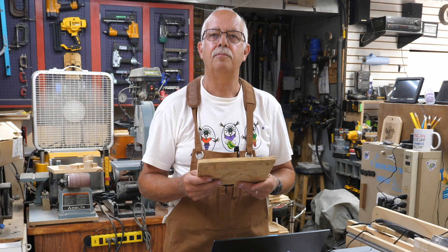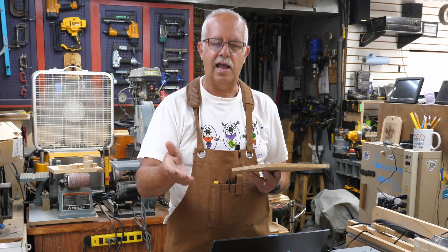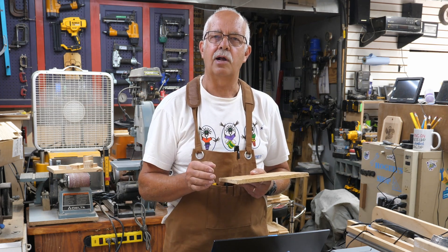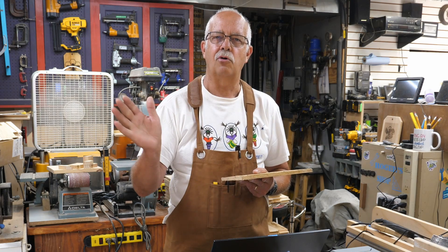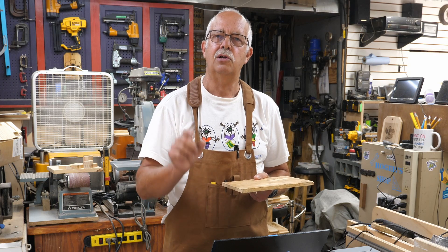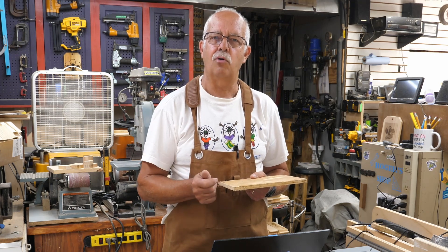The viewer that sent me an email said they had some to cut. They have a Longer Ray 5 with a 20-watt head on it — that just happened to be what I had set up here today. So I'm going to run a laser cut test on it. There'll be a link in the description for that file if you'd like to download it — it's free. It's important to run tests on any material you use to establish settings for your laser, because not all lasers are the same.